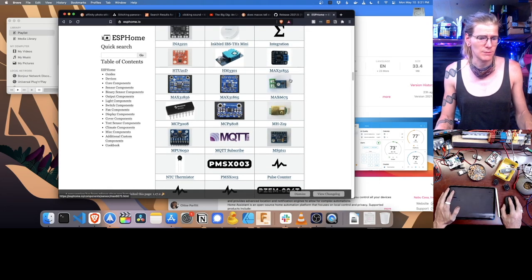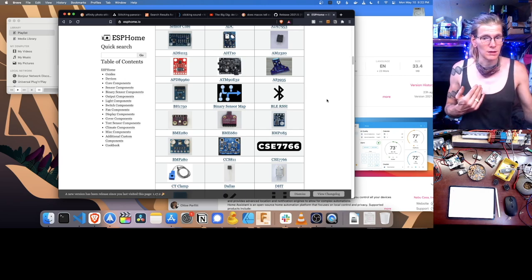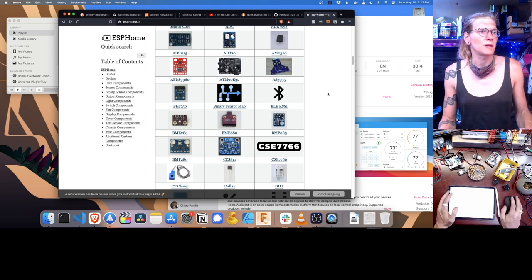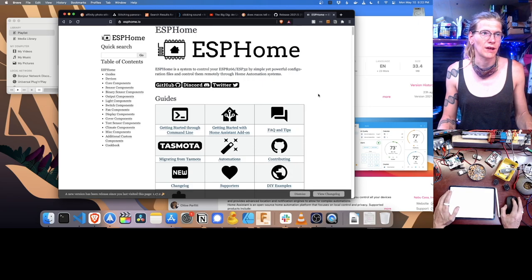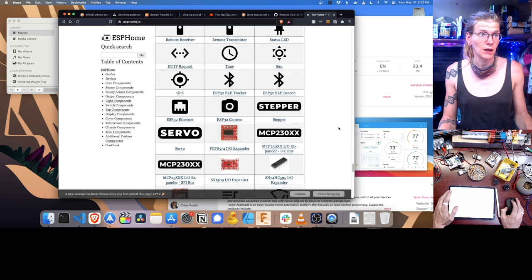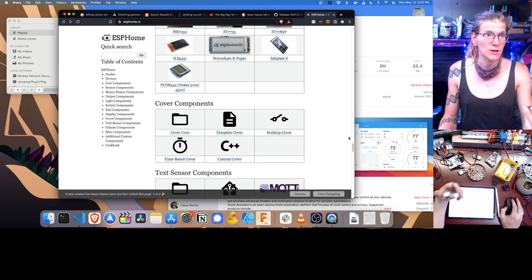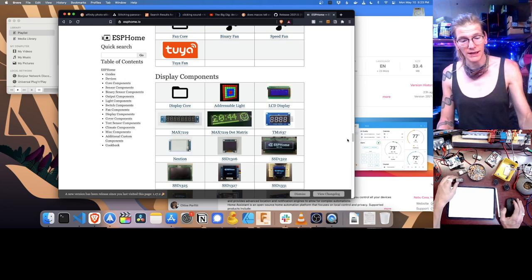And there's so many things in here. Like this is for a temperature sensor, I believe, and then you do have MQTT. Originally it was running all of the communication back and forth with Home Assistant over MQTT, but now it's actually using webhooks, an async communication that's much faster than MQTT. And what's great is that, more recently, the hardware is becoming available to do Ethernet in ESP Home on an ESP32. So ESP32s, not ESP8266s, will allow you to have an Ethernet connection on board.